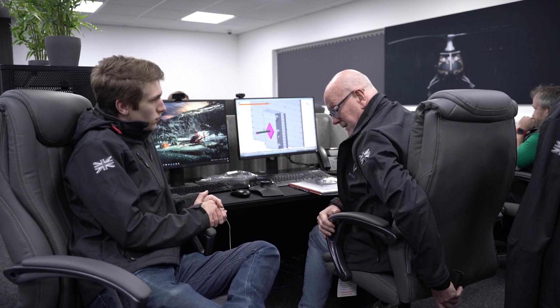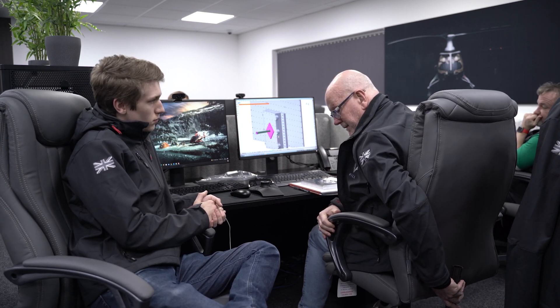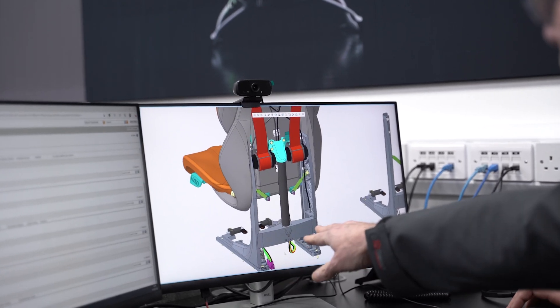Our first configuration is a single tube, where the tube is mounted on the seat centreline behind the passenger. When the seat goes into its 30G drop, this tube is compressed and crushed behind the passenger's back.